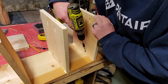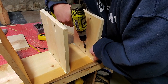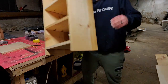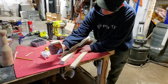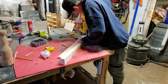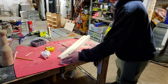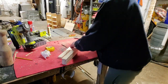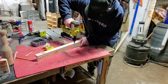I just keep working my way up, putting one shelf in at a time, gluing it and screwing it in, to the point where I can put the other side on. Now I have a completed box — one of two. I built the other one off camera so you didn't have to sit through it again. Now I'm putting together a pair of legs for the back corner so I can brace it, and that's just a simple L-shape with two one-by boards. I glue and then brad nail those together.